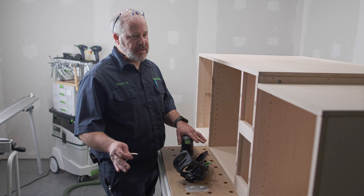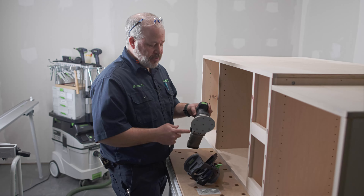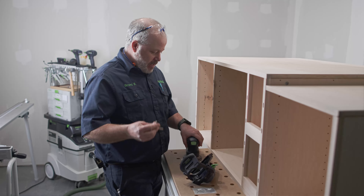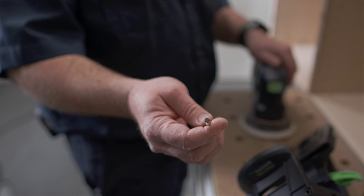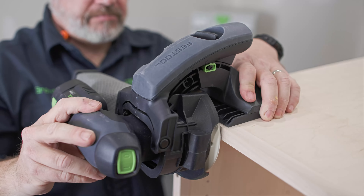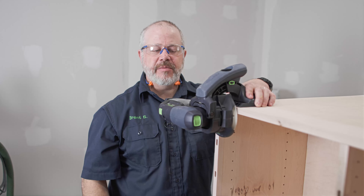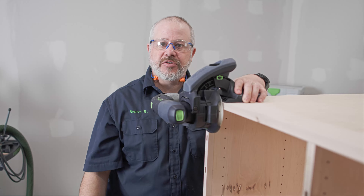With the majority of the large flat spots sanded, now I've got to work on these narrow face frames. I could do it just with the ETSC-125 by itself, but there's a chance of it rocking, so I'm going to add the edge guide to it to keep it nice and flat and square. To change that out, I'll just be using a 5mm wrench, which is included with most of our saws, to take a couple screws out and attach it. I can adjust it to whatever angle I want to sand at — which is 90 degrees for this — lock it down, then sand all my narrow face frames. If you have more questions about the sander or the edge guide, check out the link in the description.